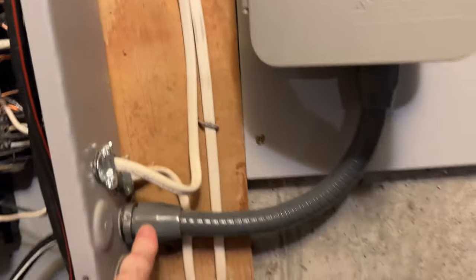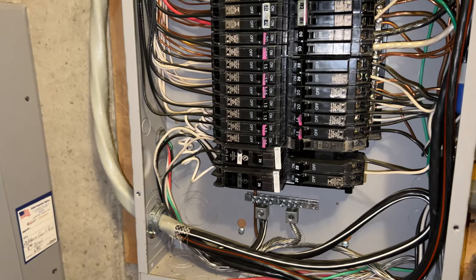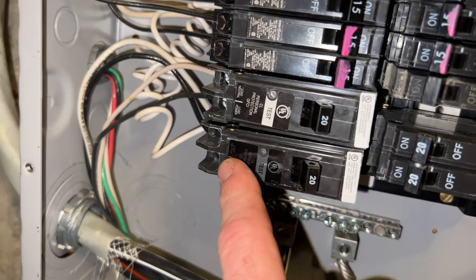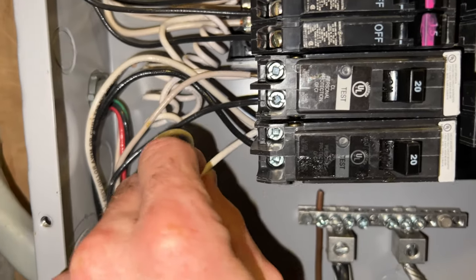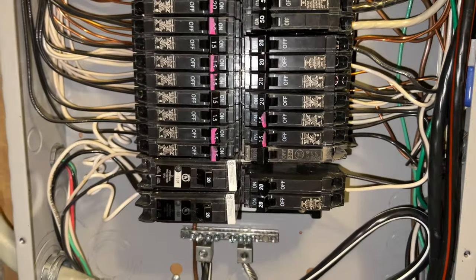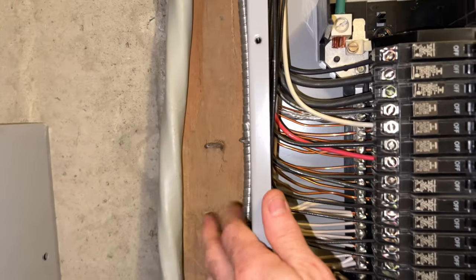This is the timer. I ran two straight carflex connectors and a little half-inch piece of carflex so I could run my single conductors to here, and then transitioned out with a piece of MC. For the convenience outlet circuit, it's going to be the same GFCI-protected 20-amp breaker. The hot and neutral go into the breaker, the breaker's neutral goes to the neutral bar, the grounds go to the ground bar, and then the wire goes directly out of the panel to the junction box where it transitions out to the pool.